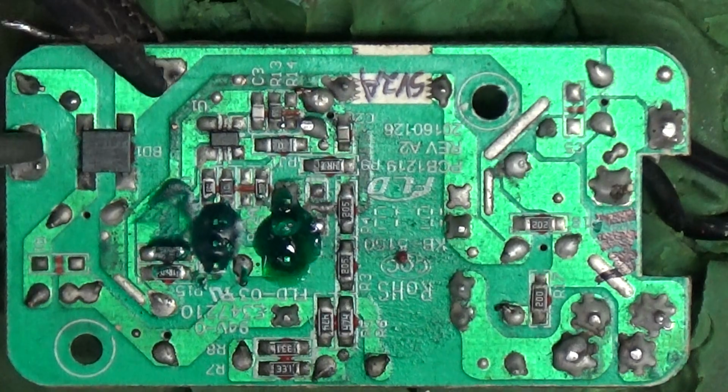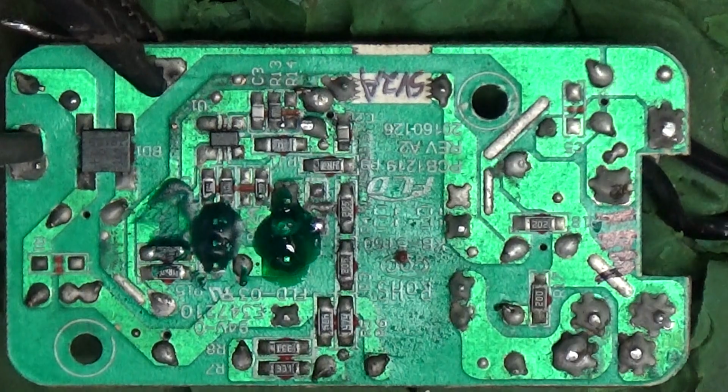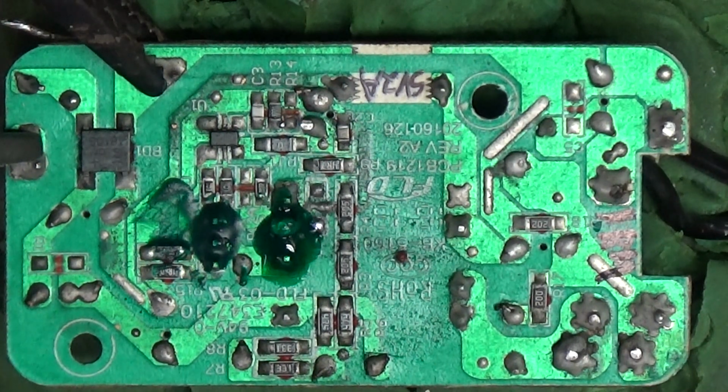Huh. Okay, 0.3. I got the thermal here. 0.5 watts, 0.6. And we're at 120 right there. 120 volts. So we're at typical North American house voltage. We're at 0.6 watts. Let's see where our heat is going. Something's got to be taking almost half a watt of heat dissipation. And there it is, that same spot.